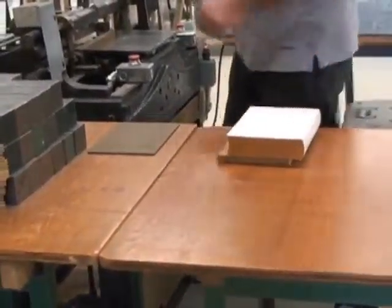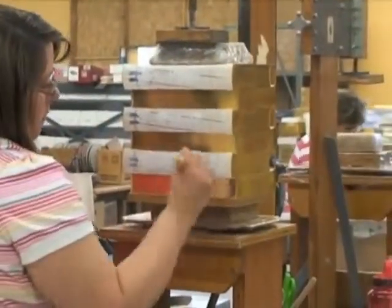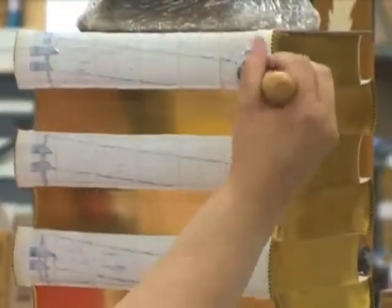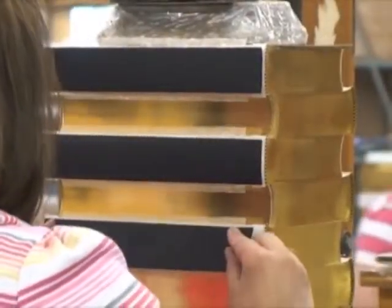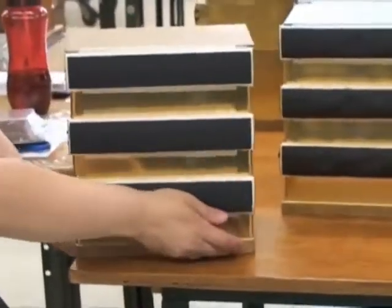We now stack them and get them ready for headbanding. This process takes about 10 to 12 minutes per stack, or roughly 2 minutes per book. We glue the ribbons down first, then glue a headband and a footband on, then glue a mesh on the cover that binds everything together — it sticks up slightly so that when we put the cover on it will bind together with the cover and hold it in place. Then we put the tube on, which has been folded specifically to the size of the book, and go through the same process on both sides of the stack.